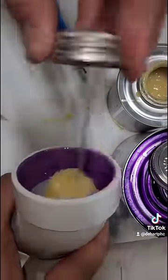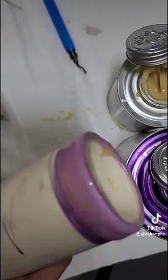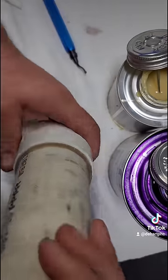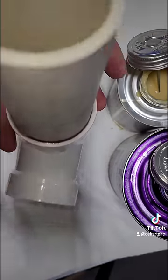So with glue you go pipe, then the fitting hub, and then back to pipe. Then we push this together and do a quarter turn. The quarter turn is important — it gets out air bubbles and makes sure you've got a clean joint.